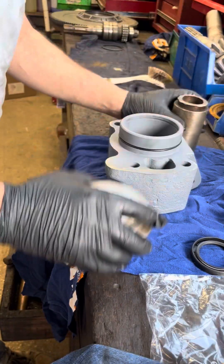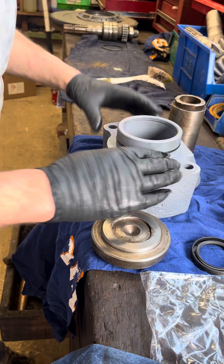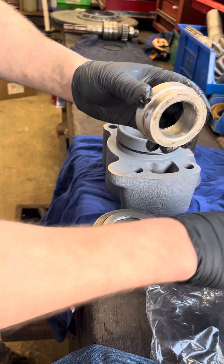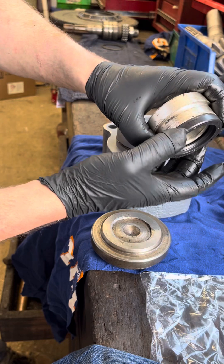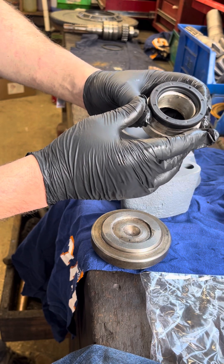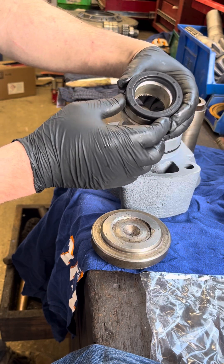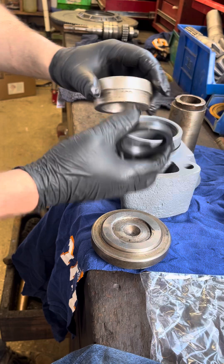I've sent that home - it's gone to the first step down. I've turned my little dolly over and the dolly is slightly smaller than the outside diameter of the seal. The outside diameter of the seal, I believe from memory, is two and a half inch, so the dolly is just slightly less. Then I'll put my dolly in.